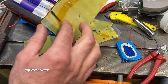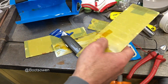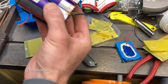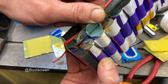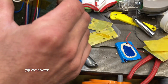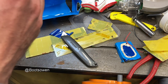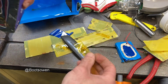So there are all our indicators. That's a temperature probe there, I'd say. It's got a bit of rust in here, so moisture has been into it, which is not great. The smoke came off the BMS and I can see some discoloration. Now, another BMS may fix it, but I'm not going to fix it — I'll just keep it for cells, I guess.